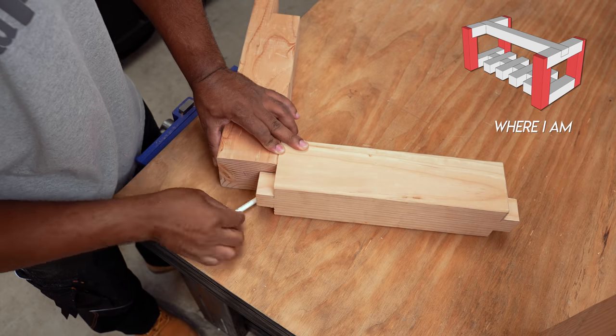You can apply a layer of urethane or varnish to make this truly outdoor ready. As far as the top, I'll allow 30 days before applying a concrete sealer. The top is heavy enough to hold its own, so there'll be no fasteners needed, just relying on gravity. Now I do plan to add furniture feet on this to lift it off the ground. I just need to find something that can withstand the outdoor elements. So if you know something, let me know in the comments.